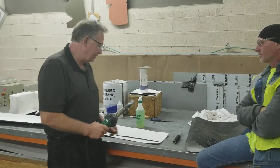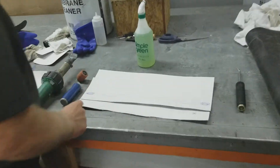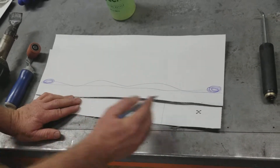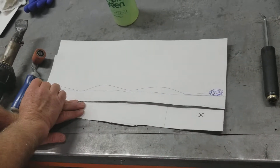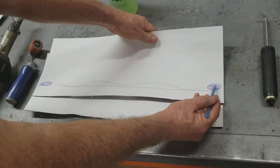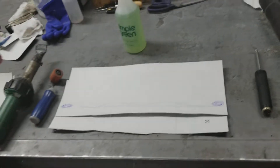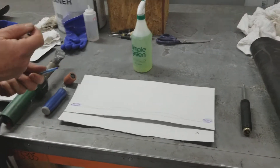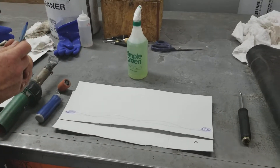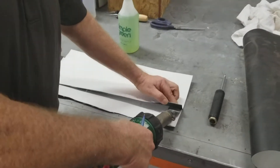But there's a problem with tacking. If I have a constant weld that I'm going to put in right down on that straight line, and I have a tack point here and here, when the sheet flutters, it will want to pull up that spot and that spot. When it does that, it tears the bottom of the membrane and will weaken the membrane. So you don't want to put tacks outside of your weld area.